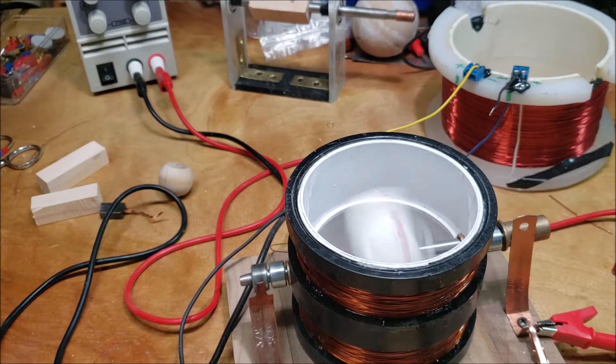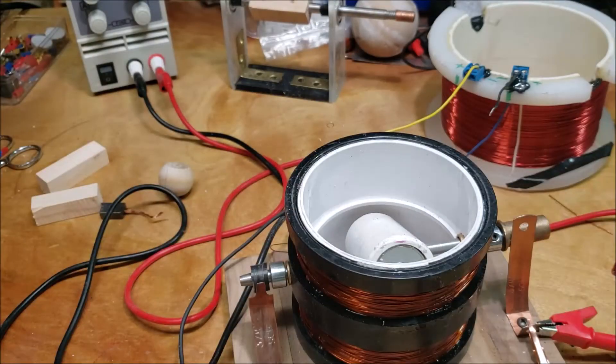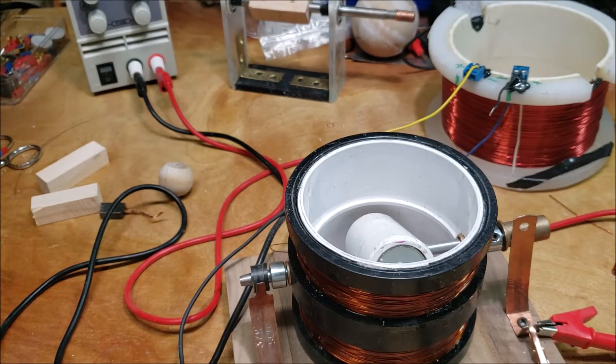So I went and got a bunch of diodes. These aren't the right ones — these are the 4007s. But I got a bunch of bridge diodes and I'm going to build a rectifier, a simple diode rectifier — it's going to rectify AC to DC. So I'll actually be able to put some of this excess energy to work and see what I can do.